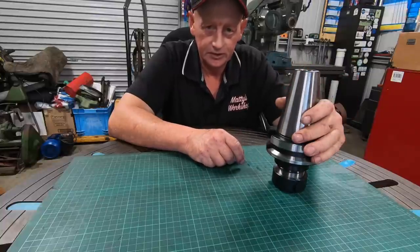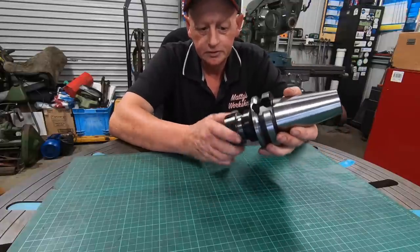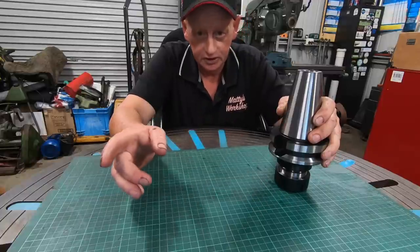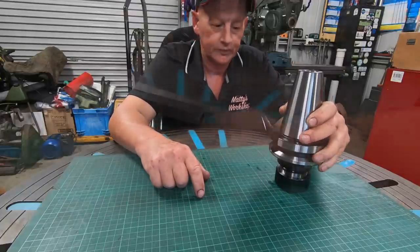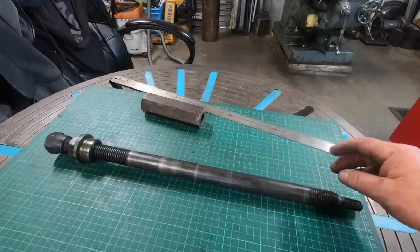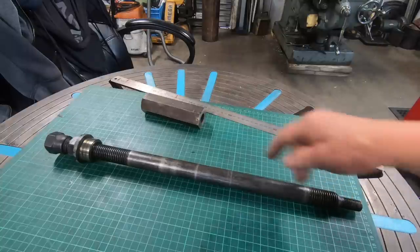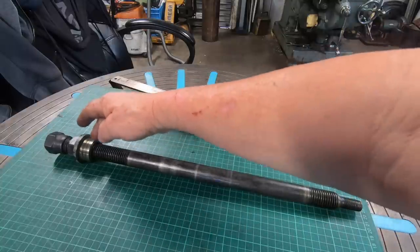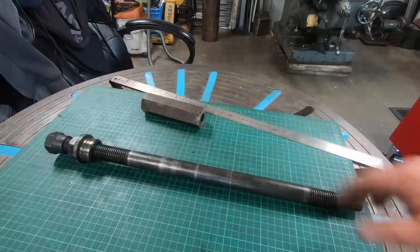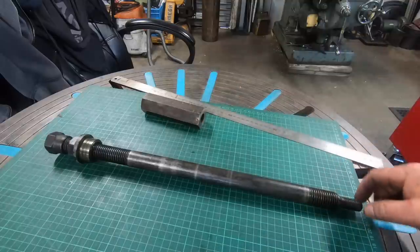I've got a bit of plate lined up that I can trim the edge off, so it should be good. I'm shooting the intro and the outro at the same time, so when you see the end of the video it looks like I'm sitting in the same spot - well, I am. This is the original drawbar - it's actually got a serial number on it. The one I have to make has to have a 24 by 3 mil pitch thread. I'm going to make the same on both ends, make a new nut. The lower collets are in the shed here, and make a new nut with a boss on it so it aligns in the spindle on the far end - same length.